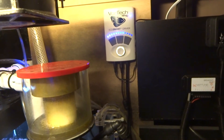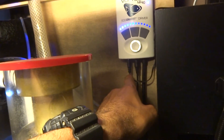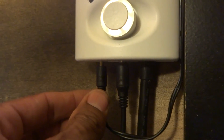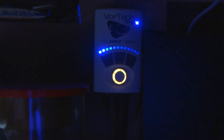Here's where the other end of the battery backup cable connects — right here into the MP-40 controller. This slot was vacant; you can see a little bit of the plug is exposed right in there, so don't try to jam it all the way in — it's supposed to be exposed like that. We'll go ahead and do a blackout test to see how it works. You can see the MP-40 is currently in normal operation mode — I believe the yellow is reef crest. I'm going to shut down the power to the system.